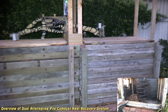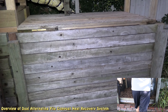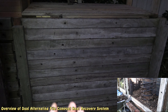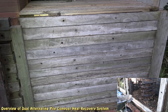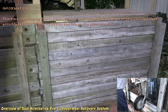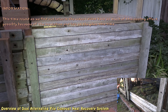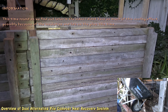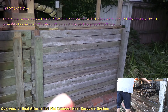Here's my new dual pile heating system. Before I run through how it works, I'll talk about the problem I had last time. Previously I only had one pile with a coil through it. The water was circulating through and warming as it went through — but at the same time, as shown by my graphs, the pile was cooling as the water was warming; it was soaking the heat out of the pile. On a sunny day it was all right because the solar helped boost the temperature. But after three or four days of cloudy weather the only source of heating was that one pile, which constantly dropped in temperature — down to about 15 degrees at the lowest.